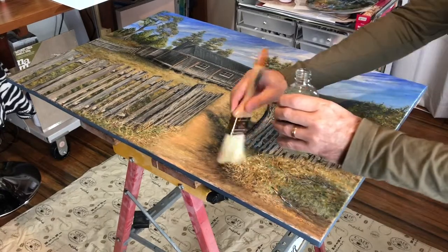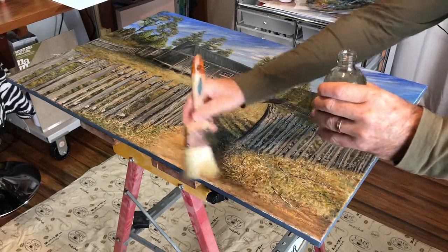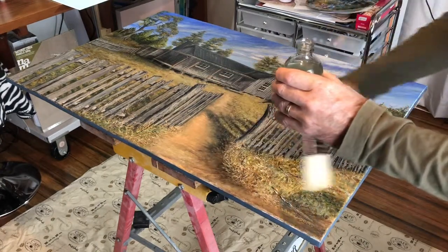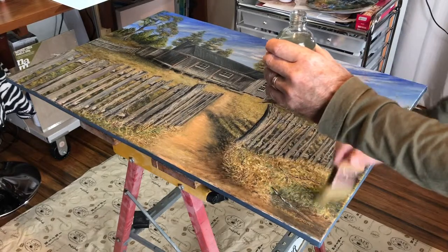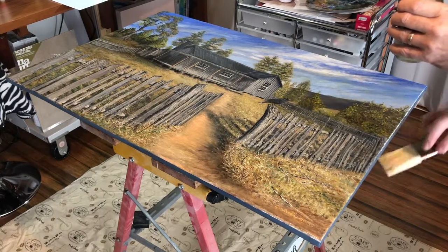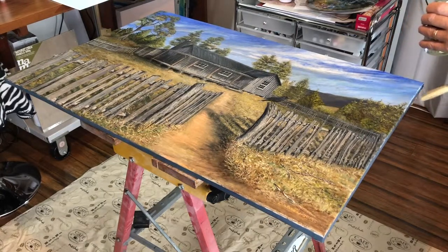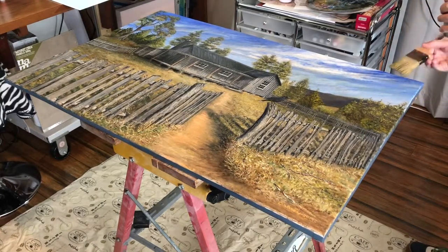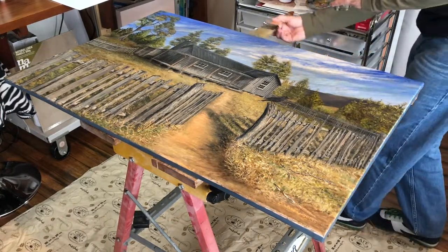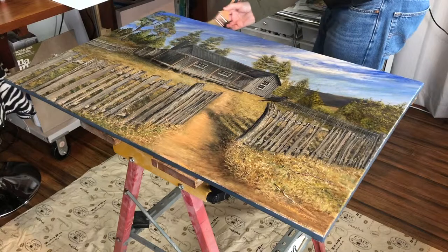As you can see, it's a very fast process — it doesn't take very long. This is one coat and I really do recommend at least two coats, as it is a bit thinner so you can miss a spot. Two coats is preferable, or even more — it's just a taste really. The thicker honey consistency varnish you might only need one coat, but generally I like to put at least two. I find I generally have enough varnish on my brush to do all the edges without re-dipping or needing more varnish.